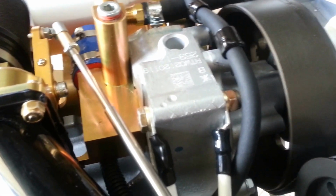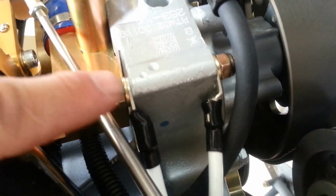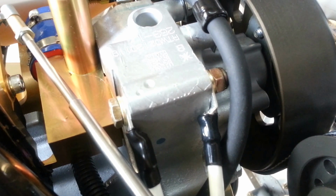which is usually a no-no, but in the same location on the engine using the same fastener. However, it is a very convenient location to ground it. They're not on top of each other, and we're using an aircraft grade number 4 bolt at the proper torque, so we know that the bolt is not going to fail on us.